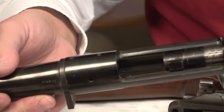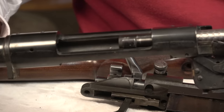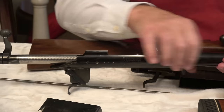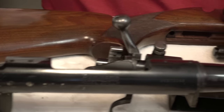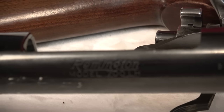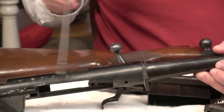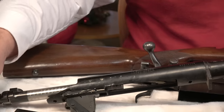The Winchester Model 70 has an integral recoil lug, while the Remington Model 700 recoil lug is a separate piece. The barrel is threaded and they drop the recoil lug piece in, then set headspace — that's the distance from the front of the bolt face to the rear of the cartridge. When the action is closed, the cartridge has to be trapped between the bolt face and the back of the chamber with no movement, otherwise the brass gets momentum, stretches, and can potentially burst. The bolt handle on the Model 700 is not part of the bolt body — it's brazed on. You can barely see the brazed line. Everything was done to reduce cost — this is a very simplified Mauser action.